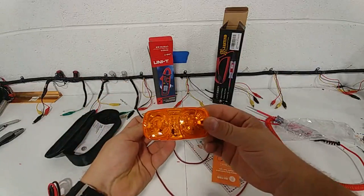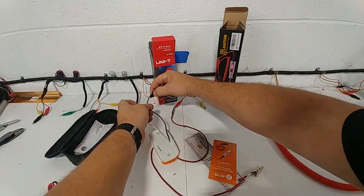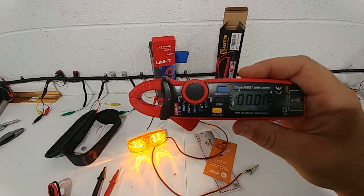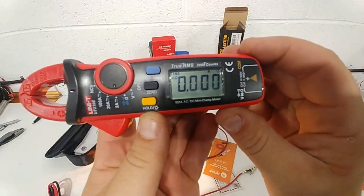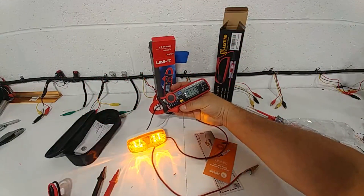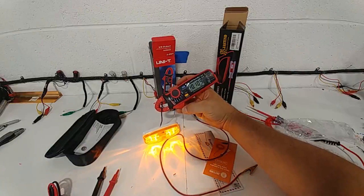Let me show you a little demo. We just got a steady burn light here — just a trailer light we had laying around the shop. We're gonna hook that up to ground and to power. All right, so here we got just a regular little trailer light. Say this was part of your system and you were wondering how many amps is that drawing? That's one light. I'm just gonna click this down to two amp, select DC, re-zero it, and now pop right over the power wire for that light — and as you can see, 0.11 amp. When I take that power wire out of the clamp it goes down to nothing. So we can tell this light is drawing 0.11 amp.